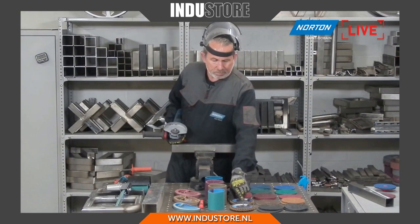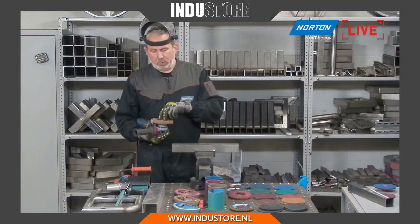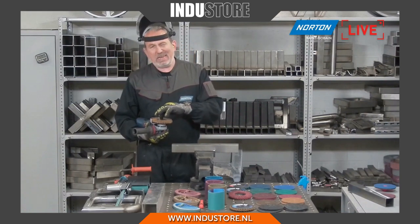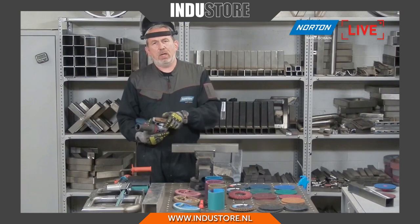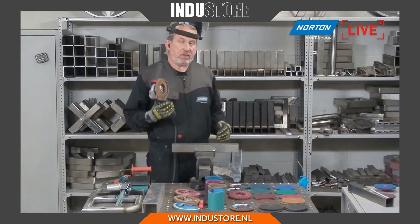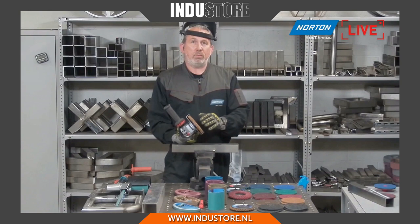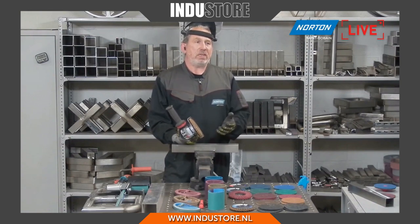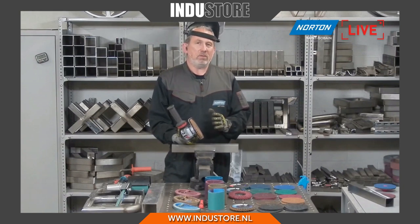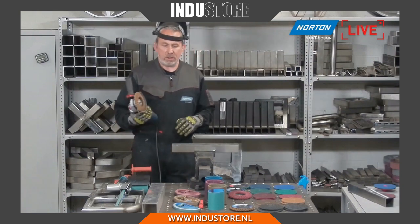So I'm going to get the coarse grade, which again is brown, of course, because that's the color for coarse. And again, we don't use grit sizes with non-wovens, because it doesn't work the same as conventional coated abrasives that use a grit size, because it's 3D. So in the coarse, we do use P80 inside this material, but it doesn't give us a P80 finish. It gives us more like a P120, P150 finish. So we don't use a grit size, we use a grade. So that's why we use grades rather than grits.